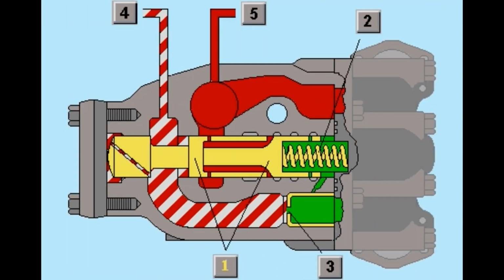The quick drop valve is a more complex makeup valve used on some medium and large track-type tractors. It consists of a two-piece check valve and spring and an orifice. The valve is located between the cylinder and the implement control valve and is normally closed.